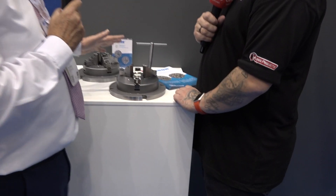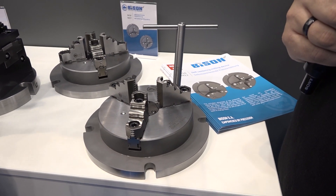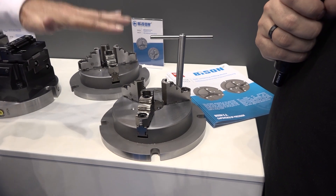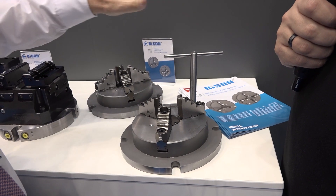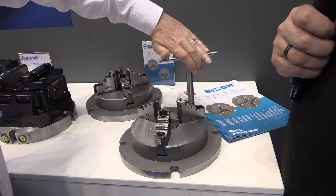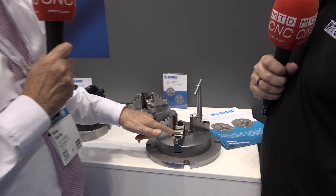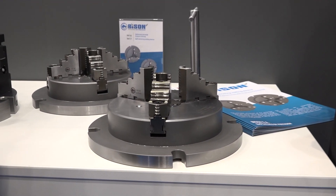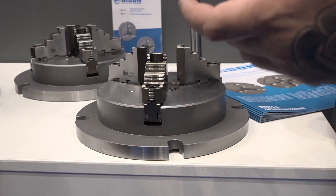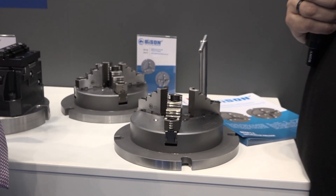Shallow chucks, or low-height chucks. This is getting to be quite a craze nowadays because on so many machines, when you put a conventional chuck in it's so high — by the time you come in to machining you're right up here. So a shallow chuck gives you a little bit more room on the machine. The big advantage these Bison chucks have is you can see they're sealed, so any swarf — more machining, less cleaning. Three jaw, four jaw, 160mm up to 315mm.